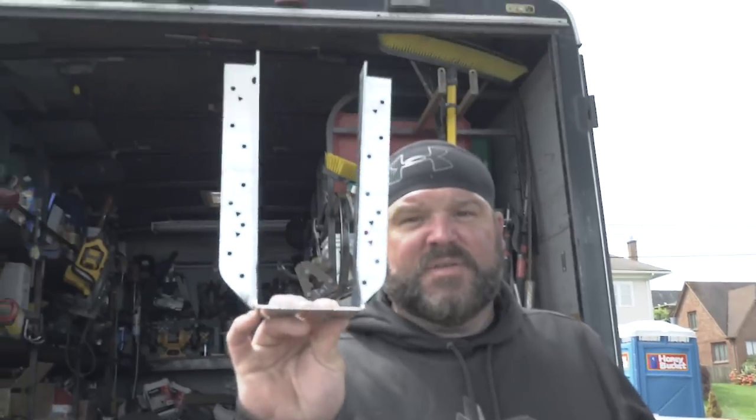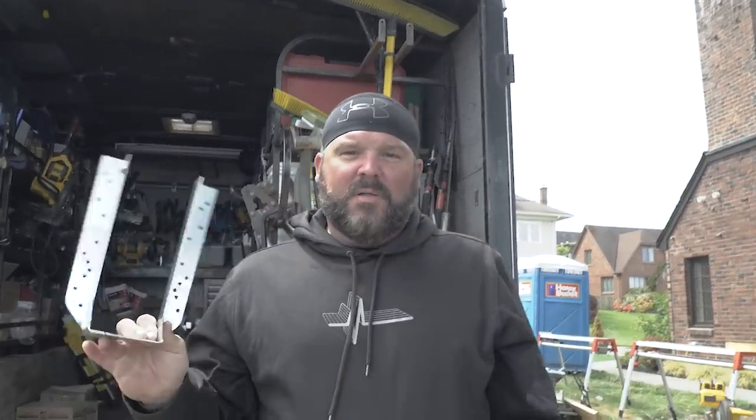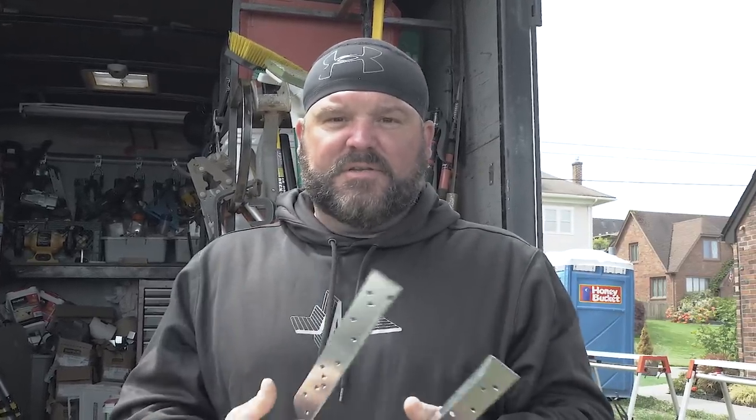That was awesome. Fun. All right, so we have our Diamond Pier pin foundations in, and it's on us now. We're ready to start framing. So first thing I've got to do is adjust some elevation on this retaining wall, and then we need to mount some of these Simpson brackets onto the wall so that our beam has a place to be locked in, and then they extend out over the top of these pin foundations, and that's how we're going to start framing the lower deck.